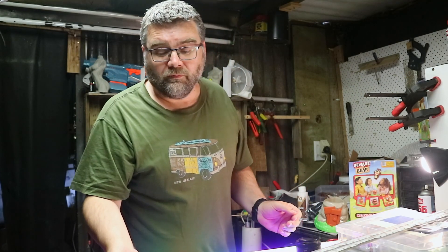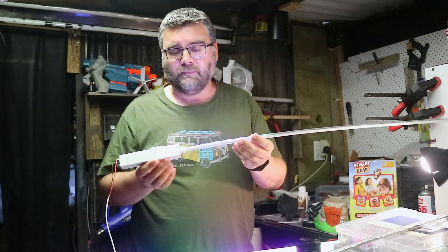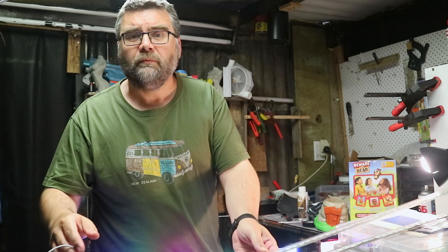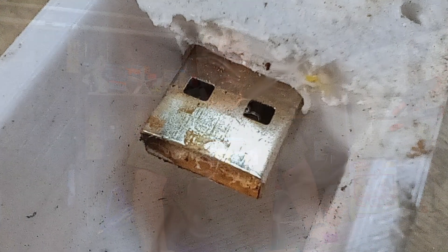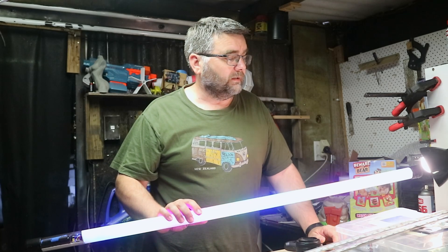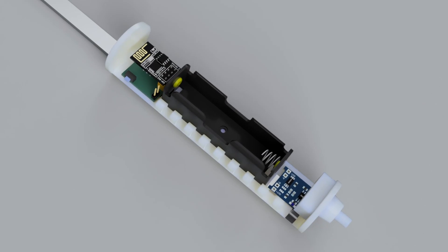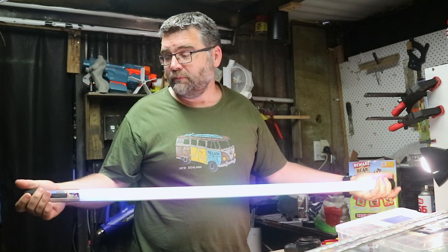So I've made all sorts of versions of this particular product using hoses. This one turns on by sliding this back and forward, because moisture is a big problem with this product. It's got USB connectors and they get wet or damp and moisture and they rust out and you've got to start all over again. So this one I went in a different route — it's actually simpler than anything I've ever designed before, which makes it easier for you guys to make. And it's going to be waterproof because it's sealed — a perfect example of keeping it simple and stupid.